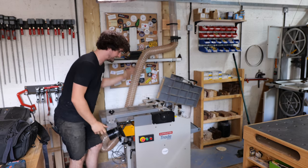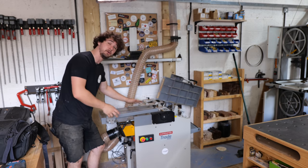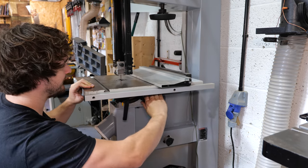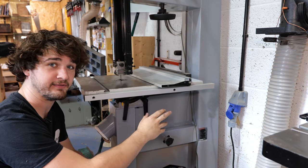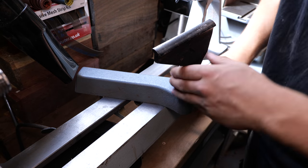This locking action — when that bed is pulled down into the bed, it's squished a load of shavings under it and as a result, that bed may be slightly off. Watch out for that on your machines. Other ones might be in the stops that set your machine back to zero — you don't want anything compressed in there or else it won't go back to zero. Or for example, in the locky thing underneath the arm on the lathe, and in many other things like depth stops and T-tracks. Keep an eye out for those bunched up shavings and compressed things that shouldn't be there.